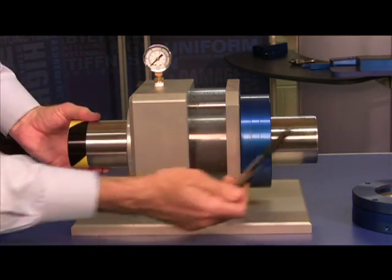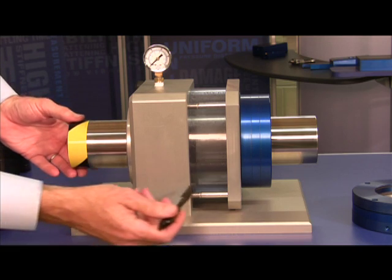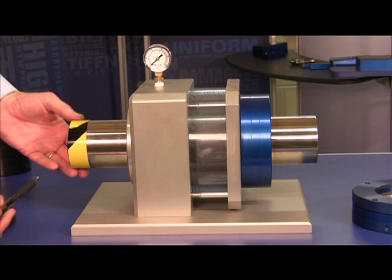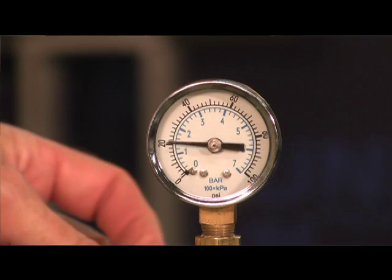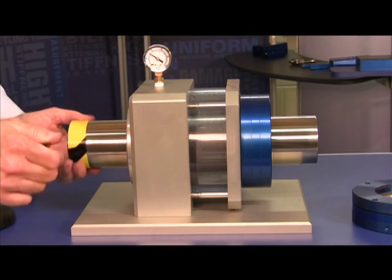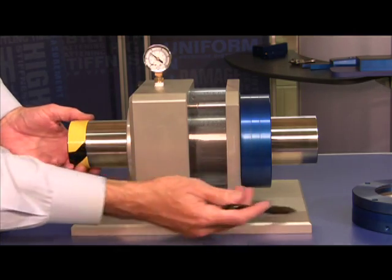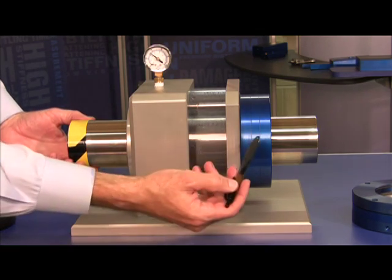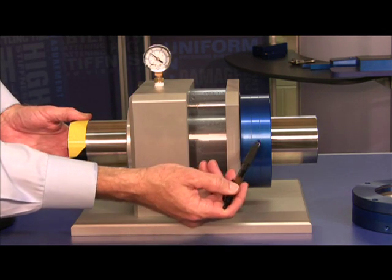The shaft is still spinning freely. There's absolutely no leak out of either side. I'm going to turn off the valve that allowed the water to come in so that we can create pressure inside of here. You can see some of the air bubbles escaping, most of them from the bushing side, flowing into this plenum. As I choke off the vent and turn that off, you'll see this pressure gauge start to rise. The shaft is still spinning freely. There we've got 2 bar — that's 30 psi air pressure inside of this plenum — and there's absolutely no liquid coming out of either end.